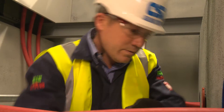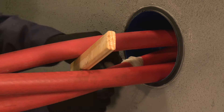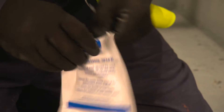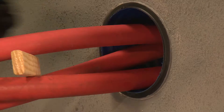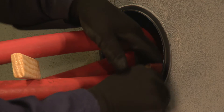The duct should also be dry. If your ducts contain running water, please contact CSD to discuss possible sealing solutions. Where there is an earthing conductor present, it is essential to move the strap away from the duct wall to allow adequate sealant to be applied. Several wipes may be needed to thoroughly clean the cables and duct. You may also wish to use a small piece of sandpaper to abrade the first 20 to 30mm of the duct to further improve sealant adhesion.